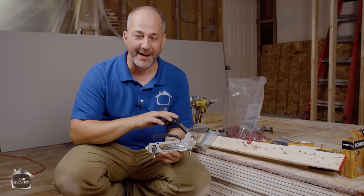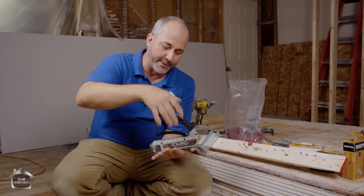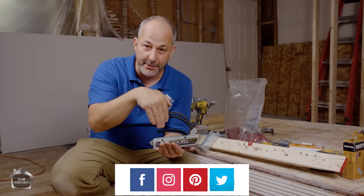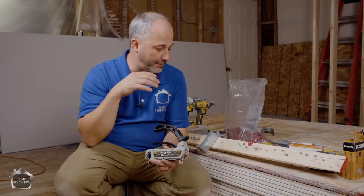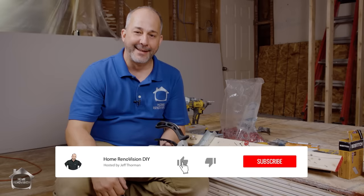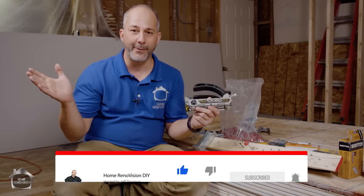The last kind of fastener I want to show you is the CAMO fastener — it's a hidden deck fastener. It locks onto your six-inch boards and you drive your screws on each side, helping you screw from the angle instead of from the surface, which protects the life of your wood. I've been using CAMO now for about ten years. If you want to see how that works, check out this deck build we did a few years ago when the channel was first getting started — an amazing two-tier outdoor living space with glass railings. Check that out, ask your questions in the comment section below, give us a thumbs up, and subscribe to the channel.